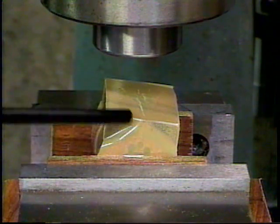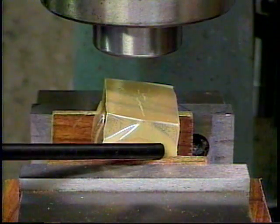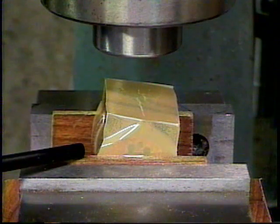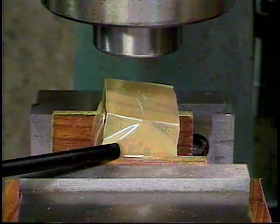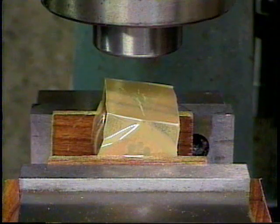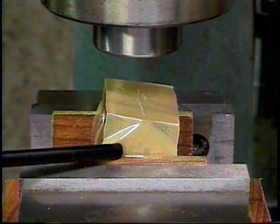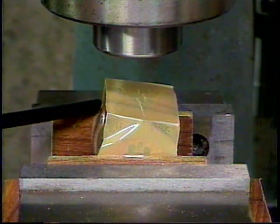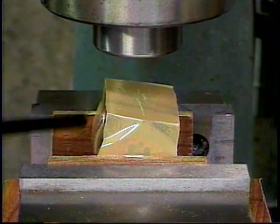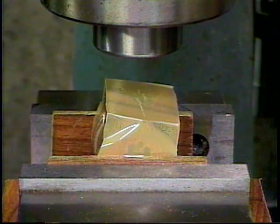I'm mounting the cylinder casting in the milling machine vise. And you can see I've protected it with tape, and I'm using pieces of paneling which are reasonably flat and true at the front and back to protect the machine surfaces. It's sitting down here on a piece of the same stock, and because I have parallel machine surfaces at the front and back here, when I tighten up this vise it's going to line me up in one direction. But you can see I'm quite cockeyed in the other direction.